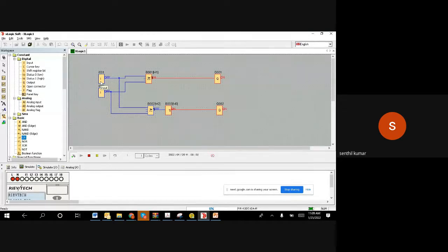So what we have seen is AND gate, NOT gate, NAND gate, OR gate. We have multiple gates, like the XOR gate also. All of them are combinations of different inputs and outputs. But the basic gates, like the AND gate, OR gate, and set-reset flip flop, play the major role. The NAND, NOR and XOR gates are additional gates, but their function you can achieve by the basic gates. As long as you know these gates and the applications, you can see how an application can be made.